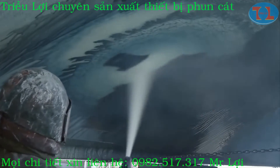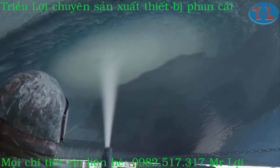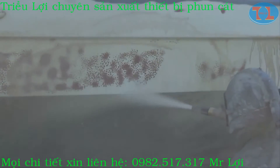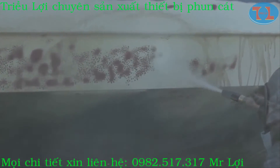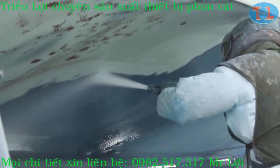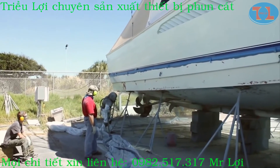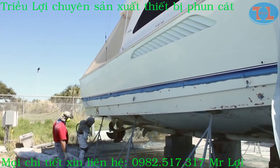The paint comes off very quickly, but by dwelling on the blistered areas for a little longer, the operator is able to open the gel coat blisters. If you look closely you can actually see the blisters. Here you can see multiple clusters of blisters that we've exposed. Notice that the ground doesn't get flooded even after a full day of blasting, since most of the water vaporizes.